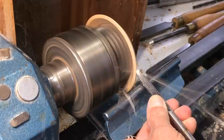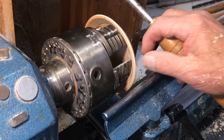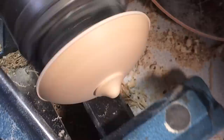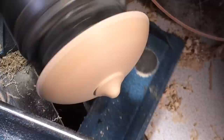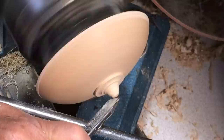I want to get rid of that sharp edge, and that's really all I need to do from that side - just get it true, get rid of everything I don't want. So now I've put the camera on the other side and we'll take a look at the foot. Having moved the camera, I find there's a teeny little ridge there. The next thing to do is to remove the button in the top, just using the wing of the tool, pivoted off the rest - just swinging into it. The tool broke off - cross-grain.